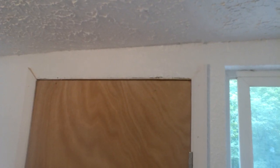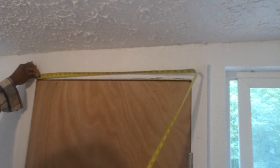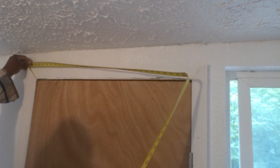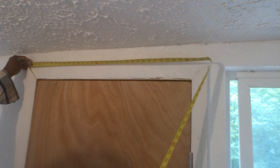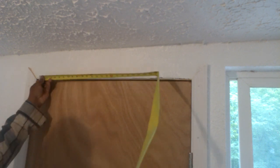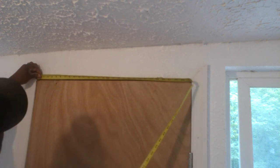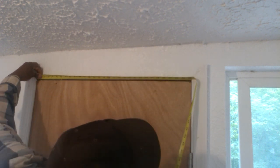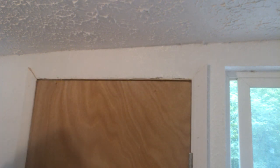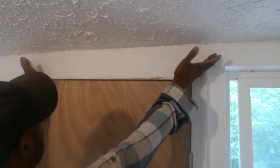Then for the trim on the top of the door, measure from the two bottom pieces and measure from the top — that's how it checks itself. But if you measure one or the other, say from the bottom to this board, I got about 30 and three-sixteenths. You're gonna go cut your board and 45 it both ways.